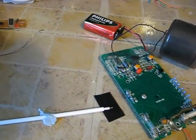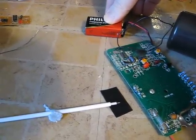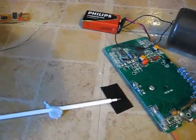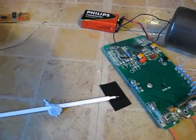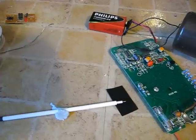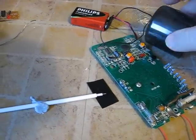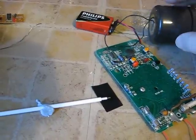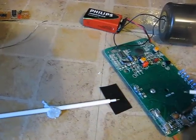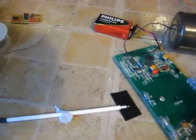It's a very simple process to wire this up to a little adapter. One of these lasts about two or three days on continuously, which shows it probably only uses about five milliamps — so it doesn't really matter leaving it plugged in permanently to power. It probably costs less than a pound for a whole year's worth of use. The little speaker has been super glued onto the back of this little plastic cup — I think it came off the top of a shaving foam can. The rods have both been made, and just before we put it into its final resting place and get the connection for mains power, I'm just going to show that this works.